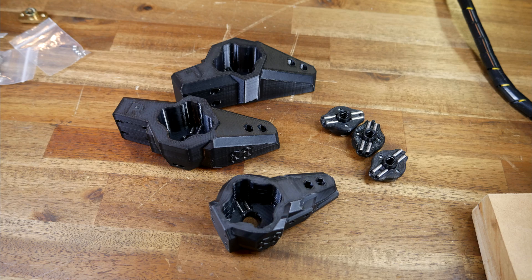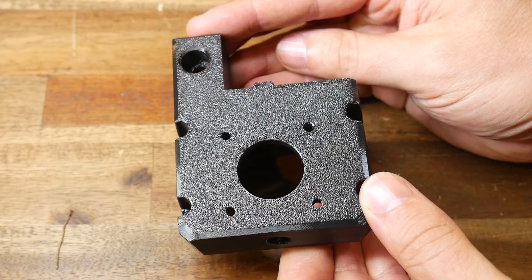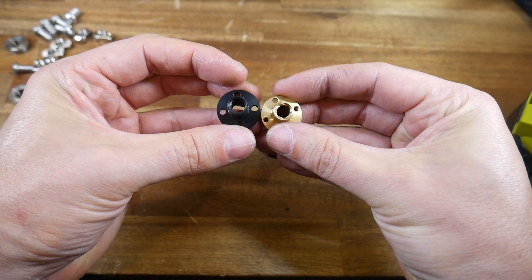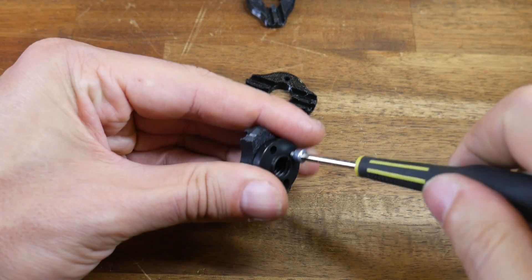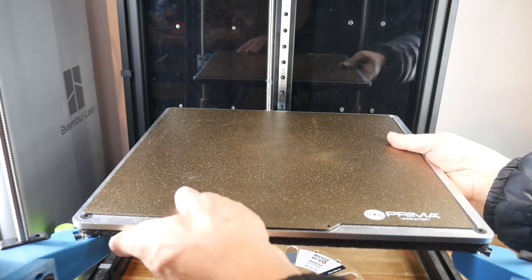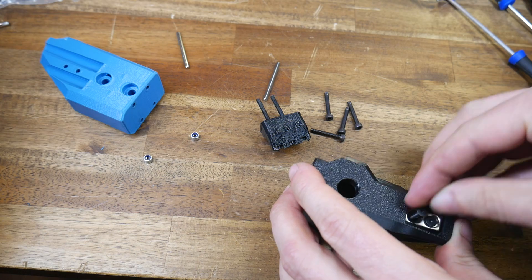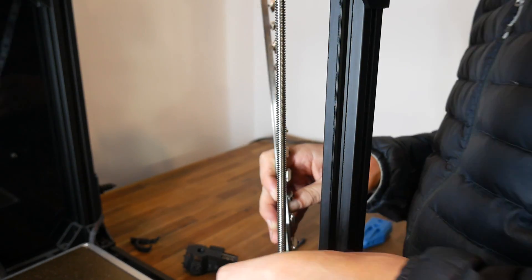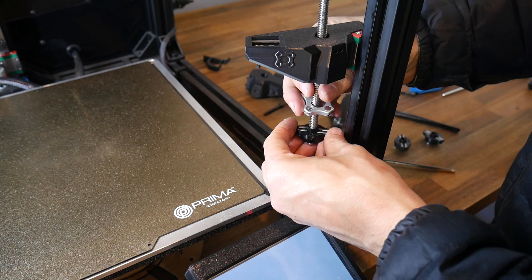As Rat Rig have 3D models of the machine online, I was able to inspect what new parts I needed to print to get Wobble X fitted. In addition to the printed parts on the Wobble X GitHub, I also needed to print top lead screw supports with a bearing in them, and a new holder for the rear center Z-stepper motor which positions it more centrally. As I wouldn't be reusing these lead screw nuts, I ordered three Delrin lead screw nuts. Rat Rig uses a different pitch to those from Creality, so look up the bill of materials for Rat Rig if you're ordering the same. The install starts just like the Creality machines, inserting the lead screw nuts onto the lower adapters, followed by the metal pins, which also have a set inserted into each of the replacement Rat Rig bed mounts.